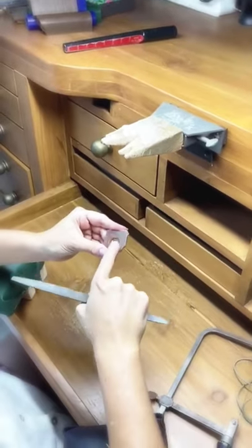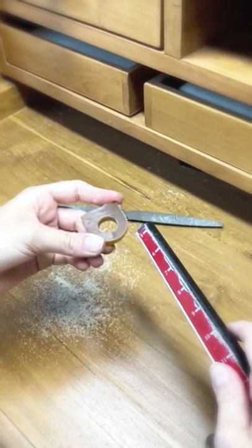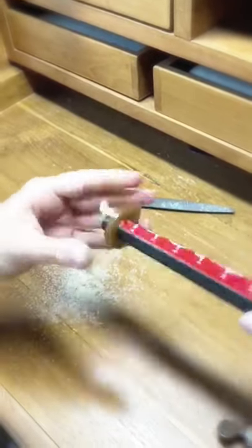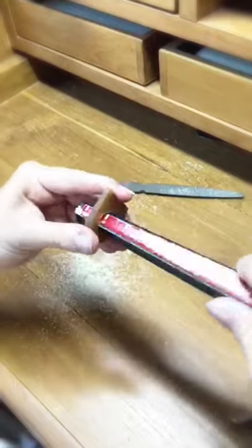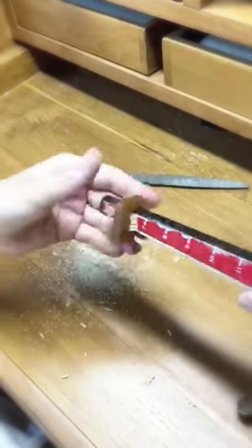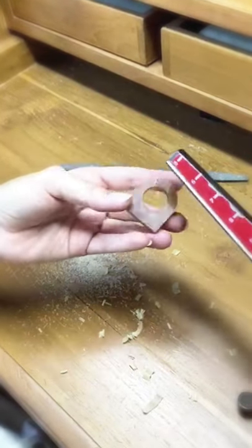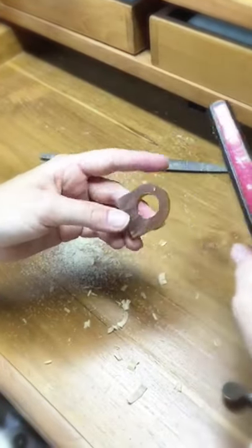As you can see, it's much smoother now — this is the jagged side from the wax saw frame. For this ring, let's make it a size seven. The hole is pretty small, so we'll stick the wax ring sizer in and twist it around. When it gets to about a six we'll switch sides. Usually I'll go just a little bit smaller than seven because during the filing process the ring will generally open up a bit more.